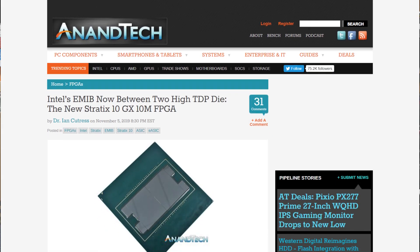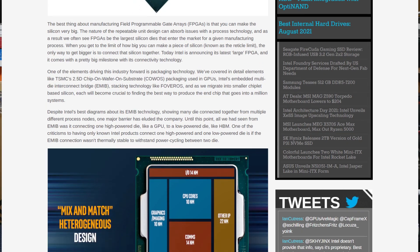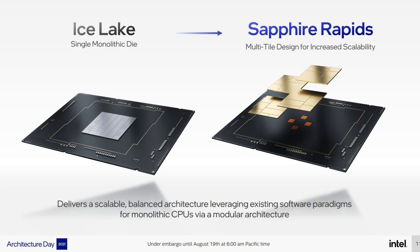Intel has been working on this technology for well over a decade and we've only seen it in a few products so far, and only one where the two die next to each other are really high powered. When you have two high-powered die with EMIB, you've got to think about flexing, bending, and material properties — but Intel believes they've solved it. They're already selling an FPGA with two high-powered die next to each other, and Sapphire Rapids will use 10 EMIBs between the four compute die, which are built on Intel's 7 process — each about 400 square millimeters for a total of 1600 square millimeters.